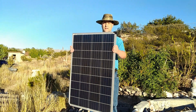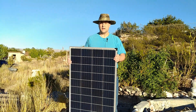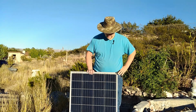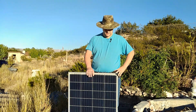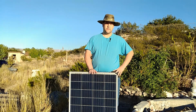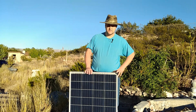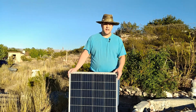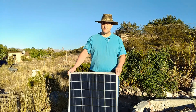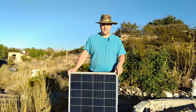Anyways, here's the little solar panel I bought. It's made by Newpowa. I'll put a little link to it in the description if anyone wants to check it out. It's a 100-watt polycrystalline panel, and I was searching all over Amazon for something that matched up with either the amperage I needed or the voltage, and this happened to fit the bill. It's a 100-watt panel, and it's pretty standard normal. It cost $100 with shipping included, so your price point is about $1 per watt, and that isn't bad.